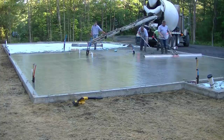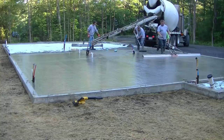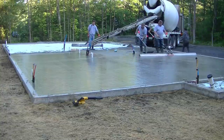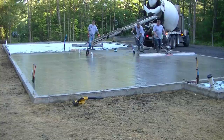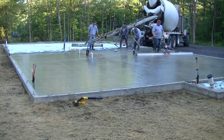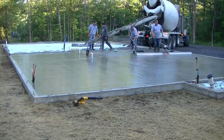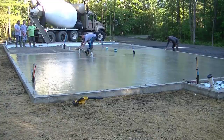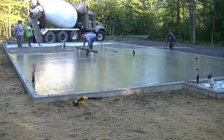You can see Tia's just got the four-foot bull float going over it and the surface turns out really nice. Because of the pace Luke is going — a nice slow even pace — he's making sure that floor is coming out really flat. Using the power screed you can go faster and give it more throttle, but we like our floors as flat as possible.